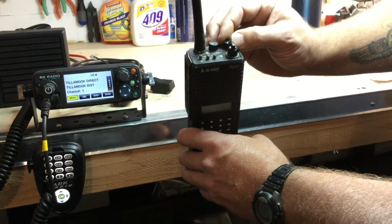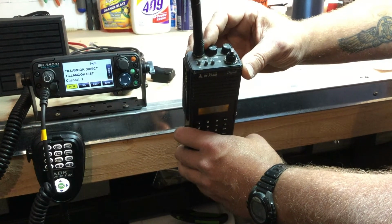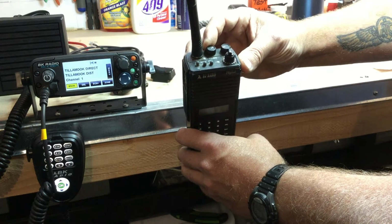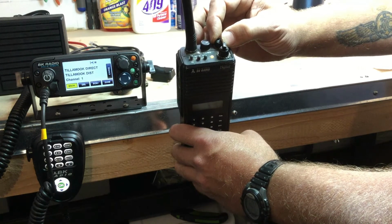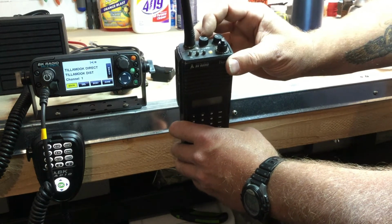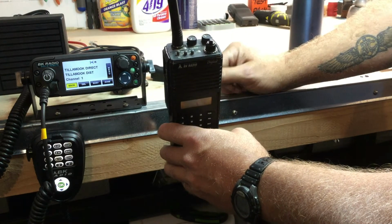However, if you do have this out of the detent position, you can open your squelch just like a CB radio. If you turn this far enough clockwise, you can actually open the radio and adjust your volume without having to listen to somebody. That way you know your volume is good. Go back to there and you're now good to go.